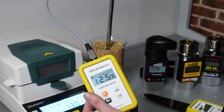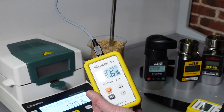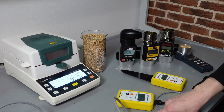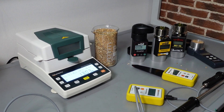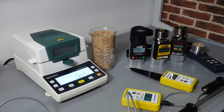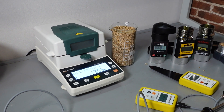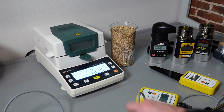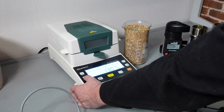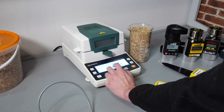So all the results from all the moisture meters are within the acceptable range of error, which is usually plus or minus one percent. By the way, what have we got from our laboratory meter? 16 minutes have passed and 13 percent of weight is lost. The process has almost stopped – the weight of the sample almost doesn't change with time anymore.